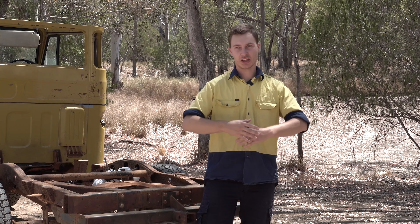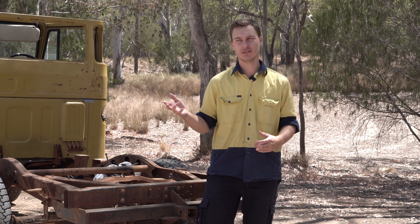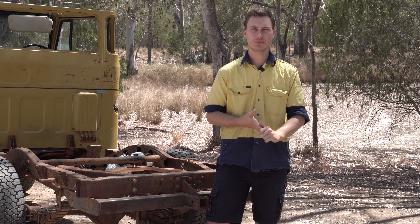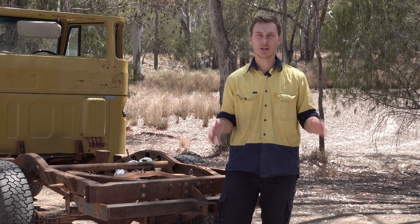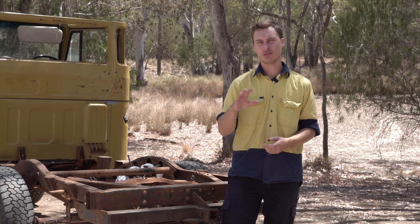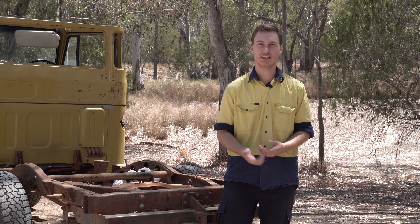The other downside is you will make a mess — sand will go absolutely everywhere. Best to do it outside, or you can do it on concrete and then sweep it up and reuse it. What we use is just sand from Bunnings, about 20 kilos worth. It's the cheapest option, about 20 bucks. Just make sure you let it dry in a bucket first — if there is any moisture it will end up jamming the end of the gun.